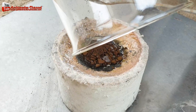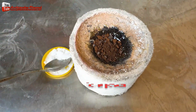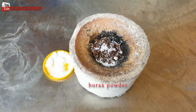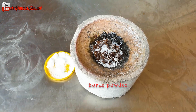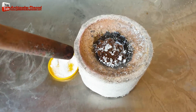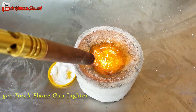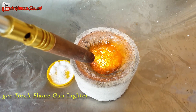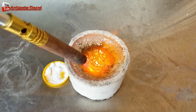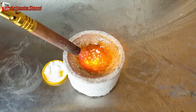For melting gold powder into cubes, mix a small amount of borax powder in the gold powder, or add borax as a topping — this improves the efficiency of melting. I use a gas torch, flame gun lighter, or spray gun with liquefied gas. Start with low heat supply, and when the gold shrinks, switch to high heat. You may also use an electric gold melting furnace or induction heater for quicker and more efficient work.